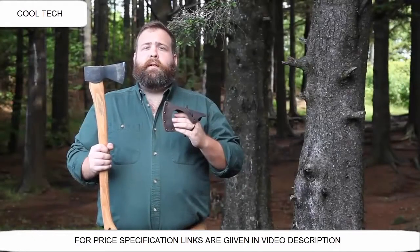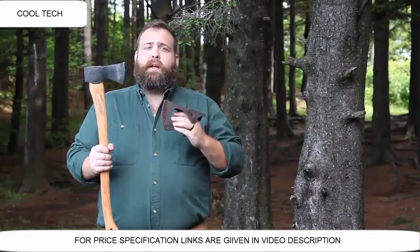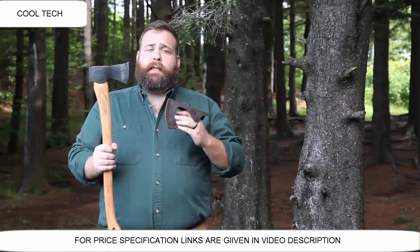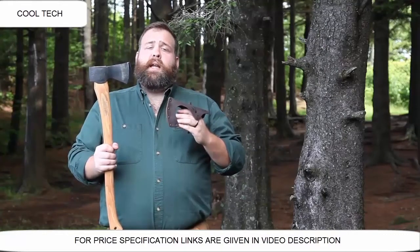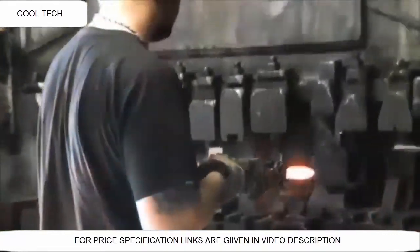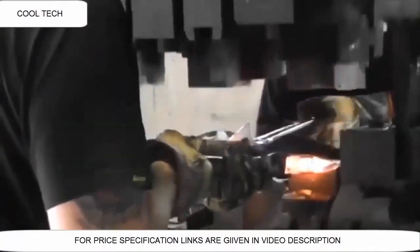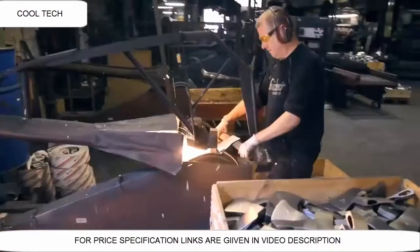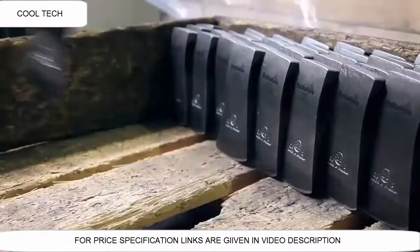Hello, I'm Patrick. I'd like to tell you a little bit about Hultafors and the Kisa felling axe. Hultafors axe heads are hand-forged at the facility located just outside of Norrköping in southern Sweden, which has been in operation since 1697. Each head is struck around 70 times to create the right shape and density. The head is made of Swedish carbon steel and has a 1-inch or 2.5cm hardened and tempered zone with a hardness of 55 Rockwell C, which creates a durable and sharp edge even after many sharpenings.